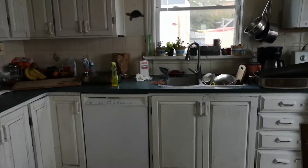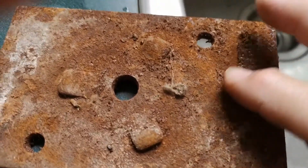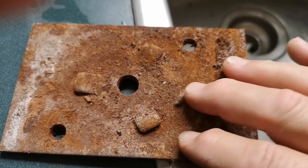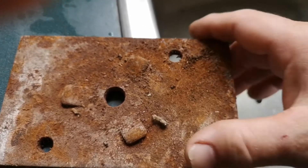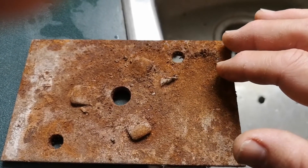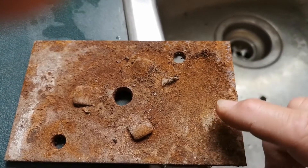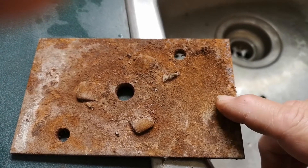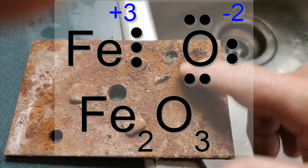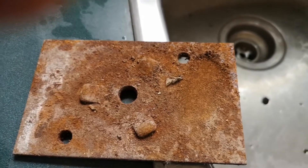Let's go back to this telepost plate. It's been in contact with concrete for years, so it's rusted. The post is steel — steel is iron with some carbon in it. This iron is iron oxide, Fe plus three. The normal red rust you see is iron three oxide. Since oxygen is minus two and iron is plus three, this would be Fe2O3, and you can see it's structurally useless — it falls apart like dust.